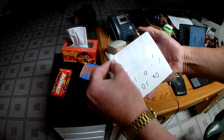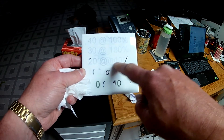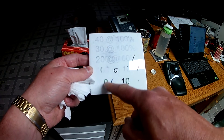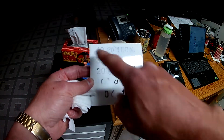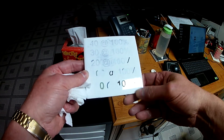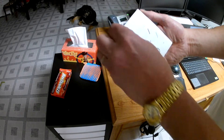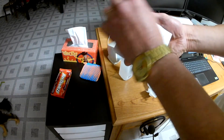I can clean a little harder over here where I know there's nothing I want to keep. It says 40 at 100, 30 at 100, 20 at 100 — you can see some zeros in there because I also did a 200 and maybe 100 at 100, trying different feeds and speeds. At 50 at 100, the zero actually burned through part of the coating, but 40 at 100 — even slower — didn't get through. It must be something with inconsistencies in the tile coating. There are people who've done this method and it's turned out really nicely, so I think spending a little time experimenting I might get something worthwhile.